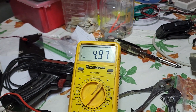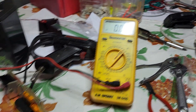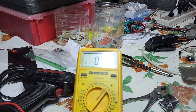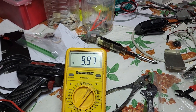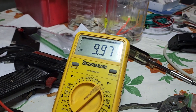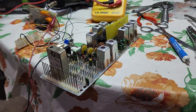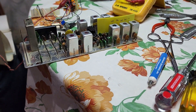For some of the folks that have been around a while, you might remember the GE Master IIs. These would typically be in sheriff's cars, police department vehicles, and similar. These are not new. We're checking the voltage — we need five volts at one point and we need 10 volts. It's a step-down voltage regulator to take it from 13 volts from the battery down to 10 volts.